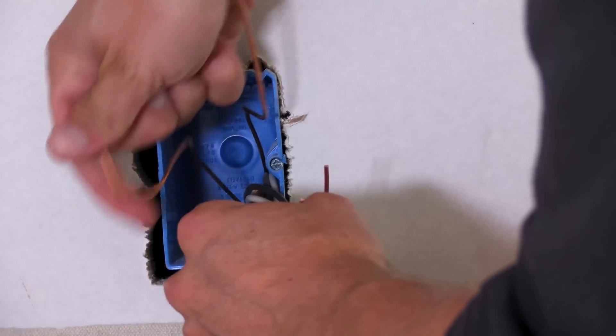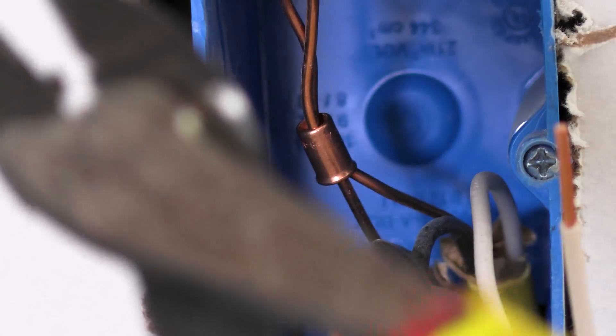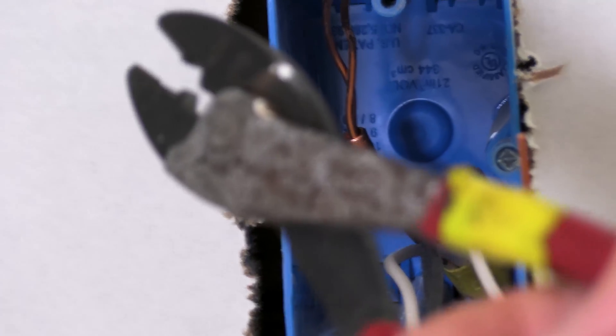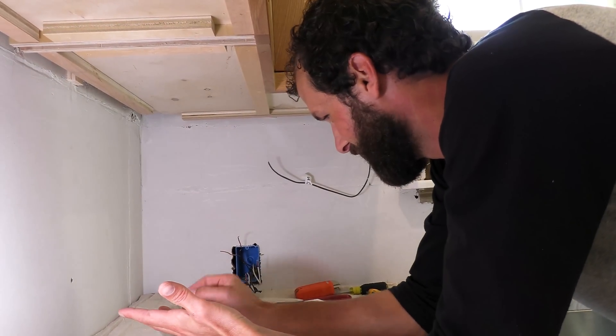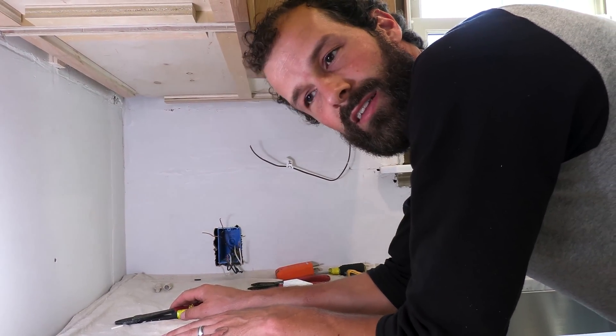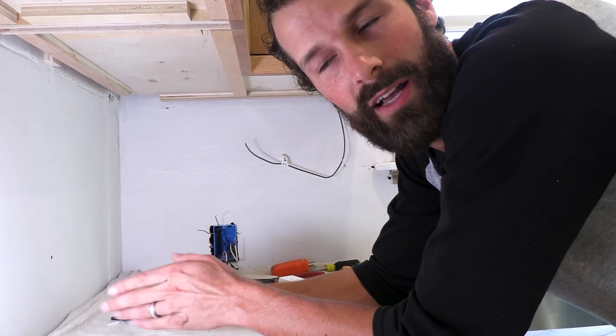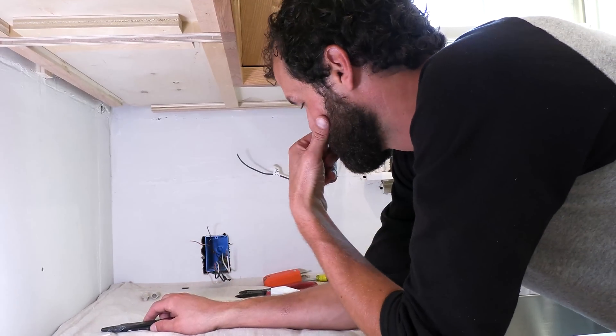One thing that's unique here is we're going to be utilizing a connector called the crimp sleeve. You can buy these at any home store or electrical supply house. You can also use green wire nuts or standard wire nuts to make a pigtail. Along with my crimp sleeve, I'm going to be introducing the diagonal crimping cutting pliers — see that jaw right there? I'm going to utilize that — the most aggressive and dynamic jaw to crimp that down and give it just shy of a death grip. Now one thing I've got to interject: you see I'm working off a drop cloth. Always, always, always — if a homeowner walks in and they see a metal tool sitting on their countertops, they're going to suddenly take a keen interest and inspect things they've never inspected before because of the suspicion you've now induced in them.